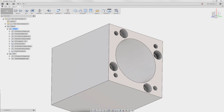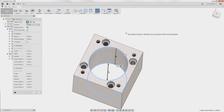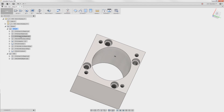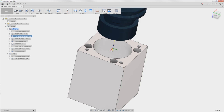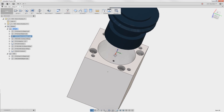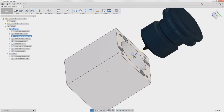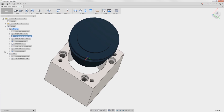How do we poke this center hole through? It's just too long for an end mill, and I don't have any boring bar heads or end mills to rough it out. So we're going to do it in the lathe. That's why we're drilling the center drill - we'll use it to locate center in a four-jaw chuck with the square part, then use a drill and boring bar in the lathe to sneak up on that diameter.